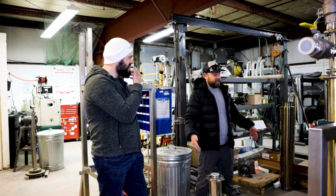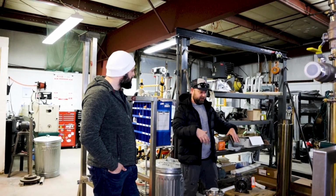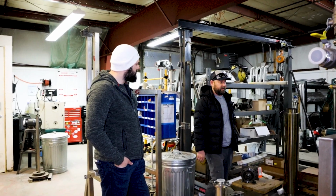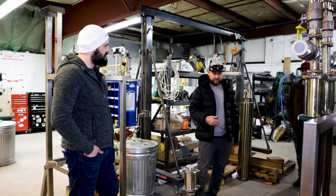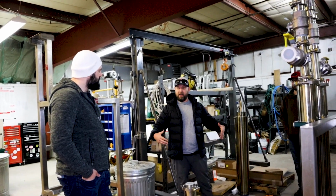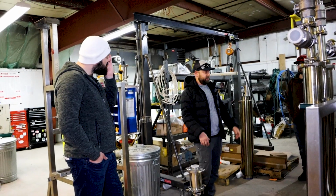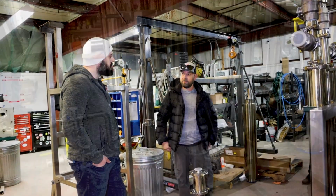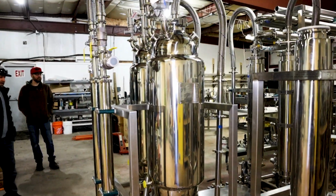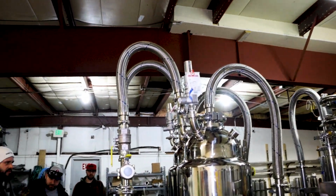And if you mount the Corkens like you're supposed to, going 8 inches into the concrete and J-hooking them, they're actually really quiet. With the smaller ones we put them on wheels, but the big ones, like the 591, we'll even put platforms so you can go 8 inches in the concrete, and they're pretty sturdy and really not that loud. So we can dampen the noise.